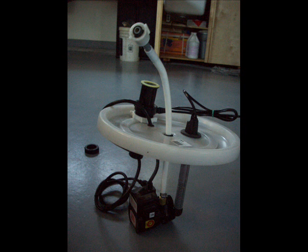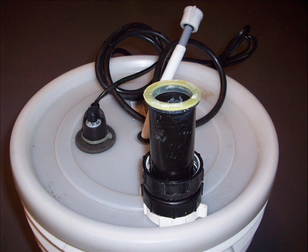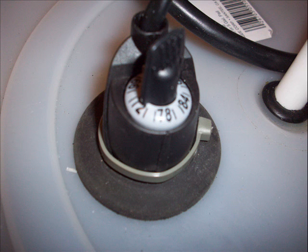Here's a closer look at the whole assembly put together. Anybody with some mechanical sense can put this thing together very easily. Put the lid into the tank of solution and make sure the pump is at the bottom. I put a little shelf so the pump stays about a half inch above the bottom so it doesn't pick up too much dirt. There's your supply bucket, your drain going into the bucket, your heater, your output fixture, and the plugs for the aquarium heater and pump motor.